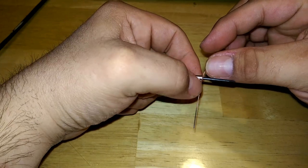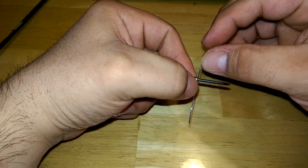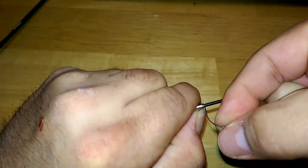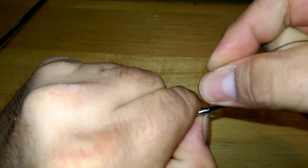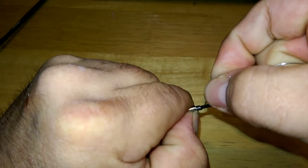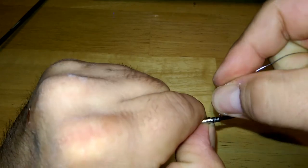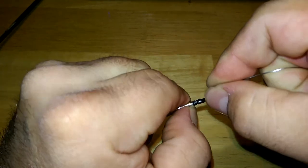You want to leave a pretty nice long leg because on this kind of coil it likes to pull in as you're tightening it up — it is a little springy when you get towards the end. So we go 1, 2 — keep it nice and tight — 3, 4, 5. Here's where we start our second one, just a little tiny space: 1, 2, 3, 4, 5.